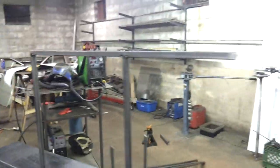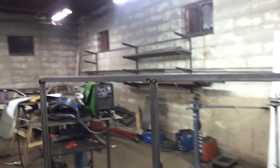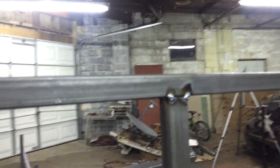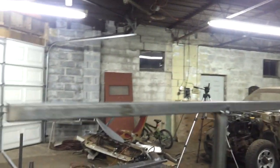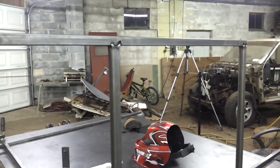Basically I have one side completely welded together — it's not finish welded but everything's tacked up. The way I'm tacking this is I'm tacking on each corner all the way around. The reason why I'm not welding these off is because this is thin wall tubing — it's 16 gauge — and with it just being three-quarter square, it will warp and it will warp fast.